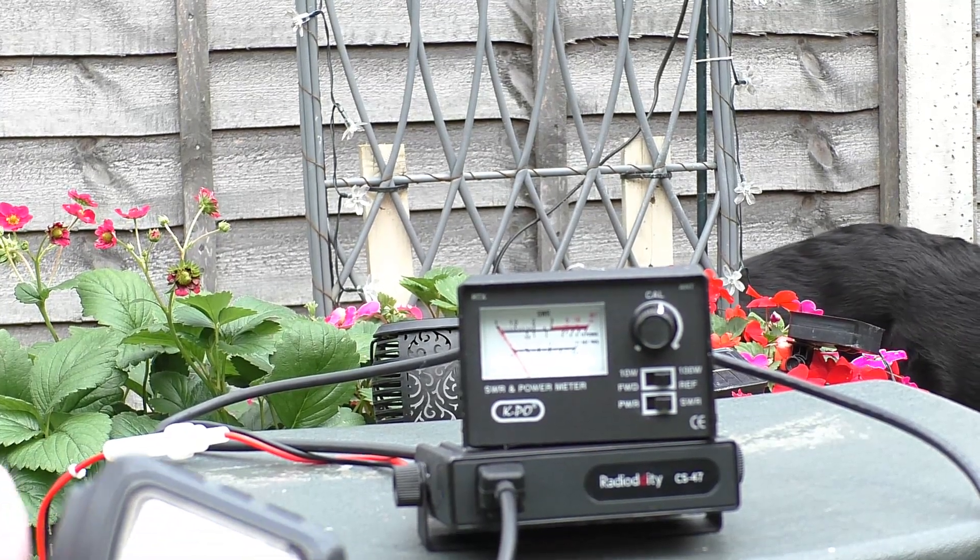Typical Thread in the Shed — I forgot to press record on the camera for the setup. Let me take you through what I've done: set the loop back up on the tripod about three and a half feet off the ground, moved it nearer the house to try a different area of the garden, adjusted the tuning controls. Got SWR of one to one on the Grant 2. Next bit: try to make contact with Dan around 4:30.